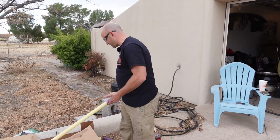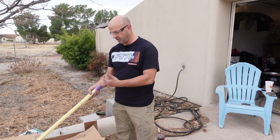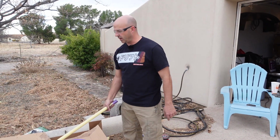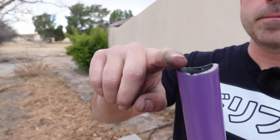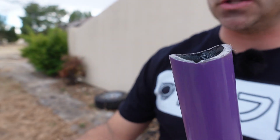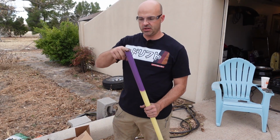That's a lot. I could imagine it being an inch too long or something because you have to cut it off and notch it so that it'll fit around here. If you look right here, this is notching. If you don't know what notching is, it's round because it's got to fit up against the round tubing of the hoop. So we're going to use an angle grinder with a flap disc to achieve this.